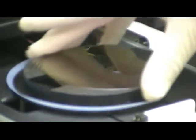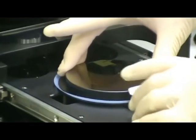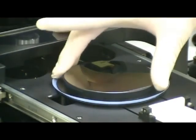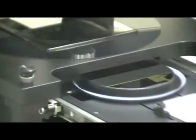Very first thing that they would do is they would take the wafer from the cassette, and as a matter of fact, you can see there's a pattern on that side, and there is no pattern on that side. And so we're demonstrating, in this case, an infrared through wafer alignment. So I'll take this wafer, pattern down, and I will load it onto the chuck. I'll flip my pre-aligner into position, just locate the wafer, flip the pre-aligner back, like so, and now I'll just load the tray in. Press load.